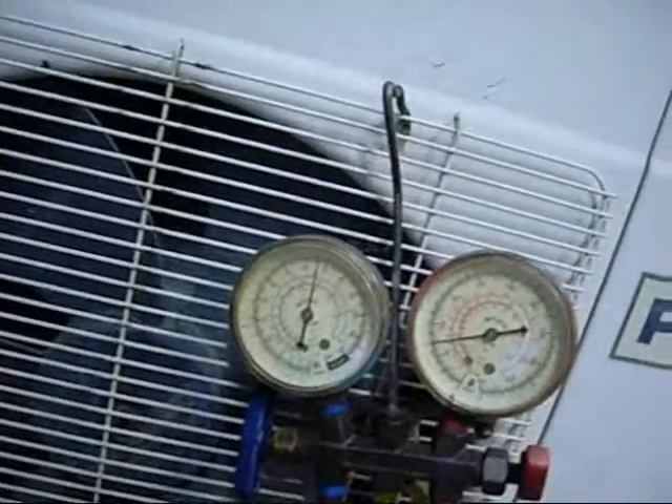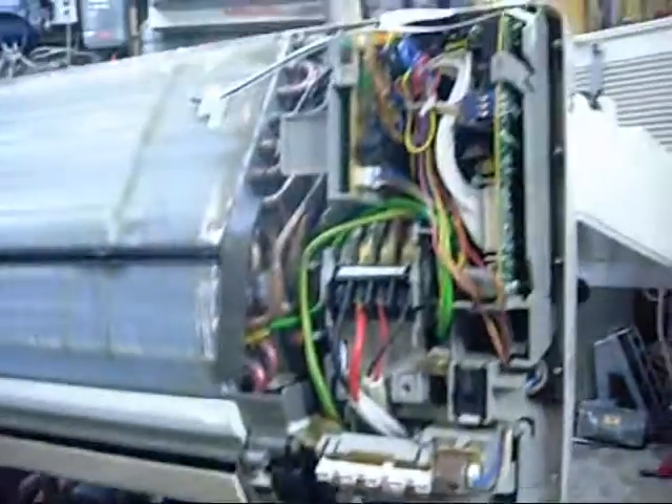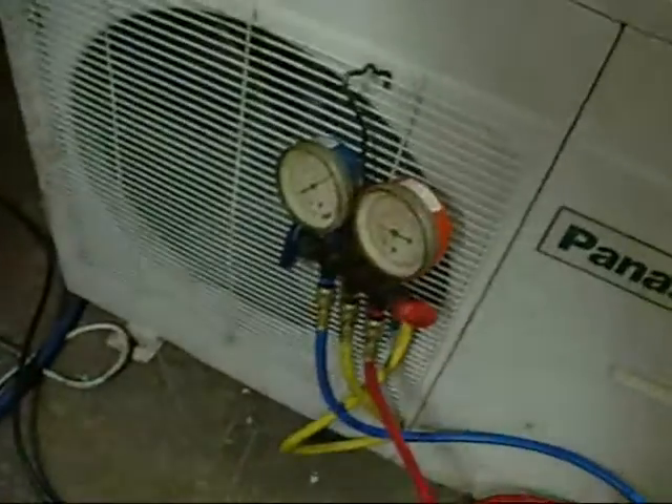I'll just gently crack the valves and let the refrigerant through gently. I'll finish wiring it up. I haven't done a dry run before releasing the refrigerant — I just want to run this thing straight away. Everything seems to be right. I've got control 2-core and power to the condensing unit. I'm going to run an external earth right now and just let this thing settle in as far as refrigerant is concerned, and I'll run an earth wire to the condenser.